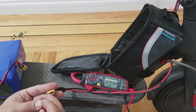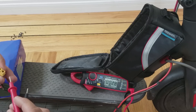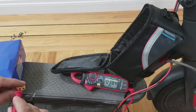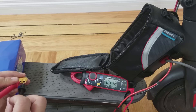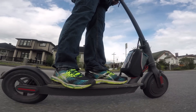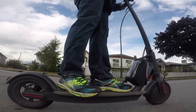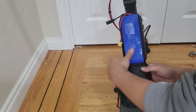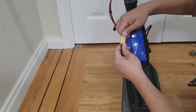Before we install the battery we must make sure that both batteries are at equal voltage, with a maximum allowable difference of 1 volt. The best way to achieve this is to fully charge the original battery like normal and then fully charge the add-on battery with a 42 volt charger commonly used in budget electric skateboards — I'll have a link to this charger in the description below. You could also use up the battery in the scooter until the voltage matches the add-on battery. Once the voltages match you can install the battery and then plug the add-on battery into the extension harness.